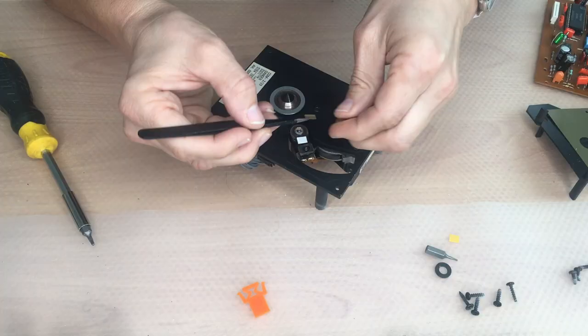As a conclusion, the weight of the two-sided tape, which I used to put the plastic panel of the focus back on, is of course higher than the original solution. It seems that the weight is too high in a horizontal position and the lens is not able to focus anymore, even when the optic is moving freely. In a vertical position, due to less earth gravity, it is working. As I said, I will keep it that way and we'll see how it performs in the future.